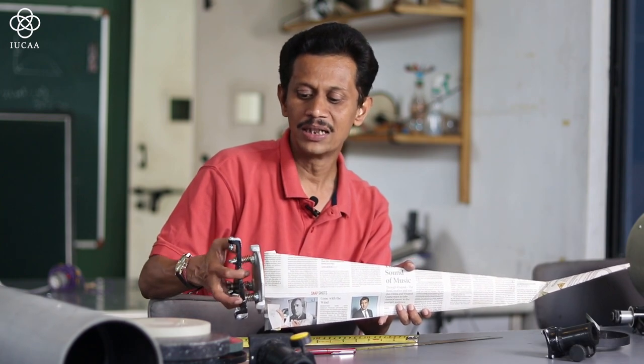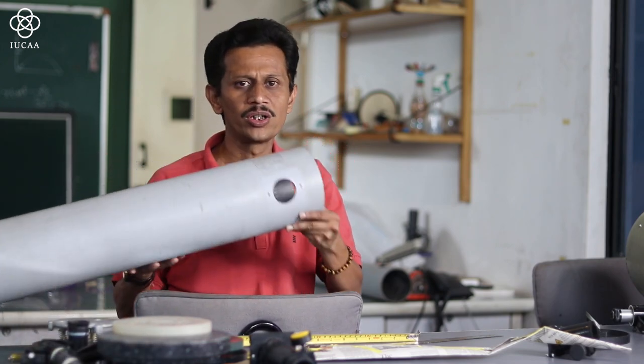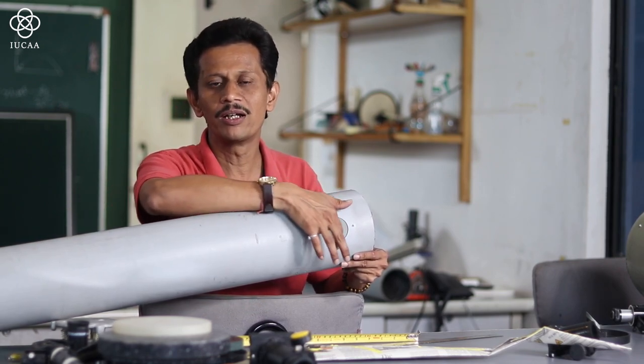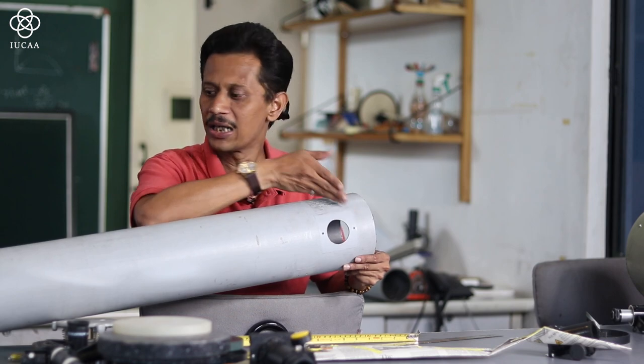So this distance from the center of the focuser to my mirror cell center or mirror cell drill, I can calculate, and according to that much distance I will drill a hole for my mirror cell. So it becomes easier, and you can adjust the mirror. Once you have made a slightly bigger hole for the focuser, then it's very difficult to adjust the mirror cell, and you cannot undo a bigger focuser hole. So the best thing is to start calculating from this point and it becomes easy.